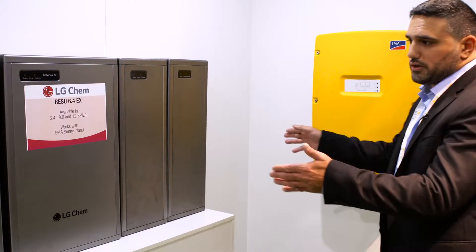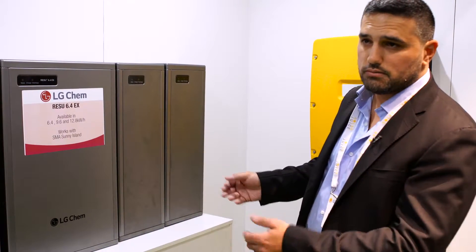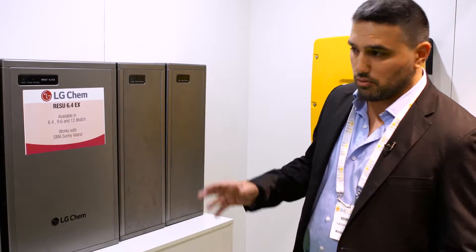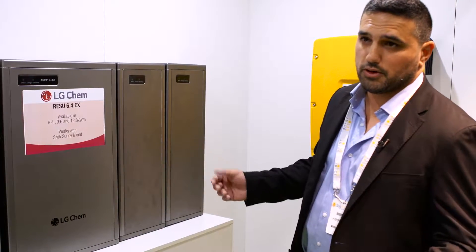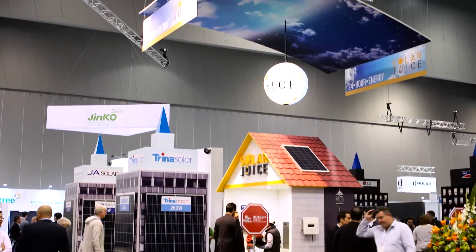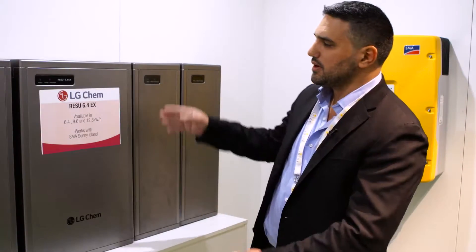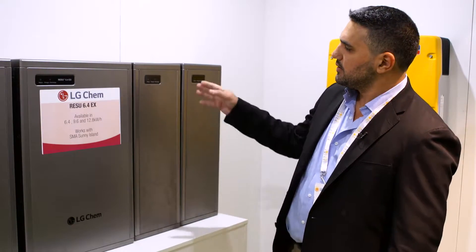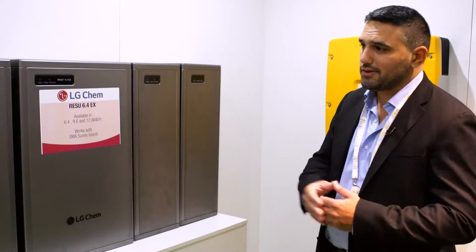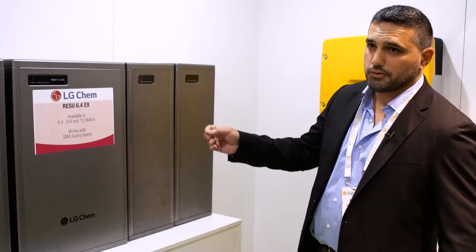Basically what you're looking at here is the maximum potential that you can put in your household, which is 12.8 kilowatt hours. And to get 90% of that quite indeed fulfils the household need. So the master battery at the moment is the 6.4 — you can only get that initially, so you can't get two 3.2s. Then if you want to expand the system, you'll go to 9.6 and then to the 12.8. And for an everyday family need, we're really working with the 6.4.